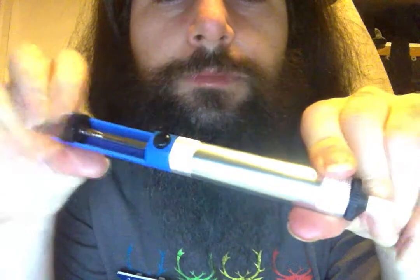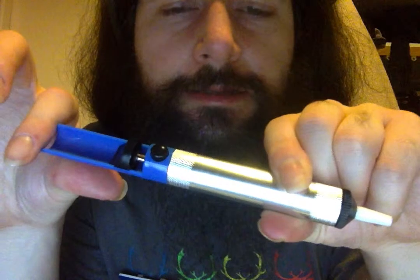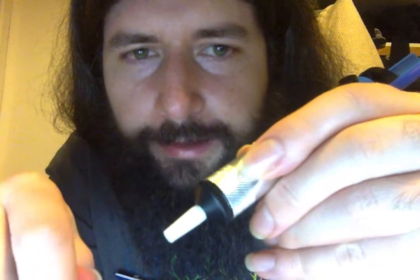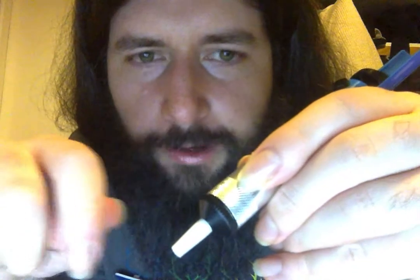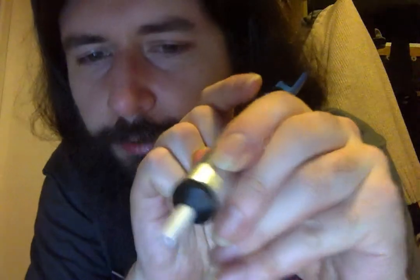Let's see that. You pressurise it, set it like that, put the nozzle above your solder, put your soldering iron there, melt it, and then make sure it's very very damp — very wet — and then as quick as you can, move the iron aside, put the nozzle there, and boom. You might need to do that a few times.